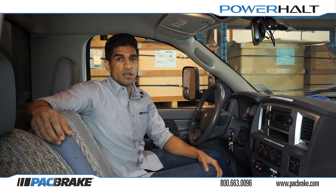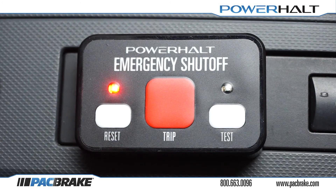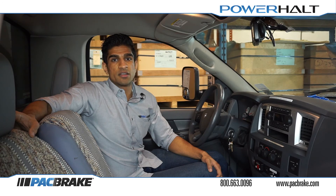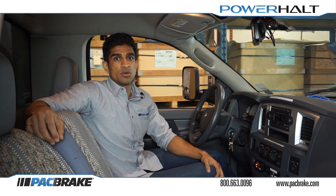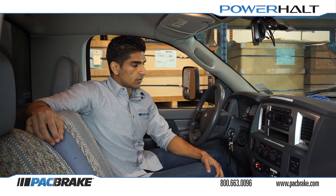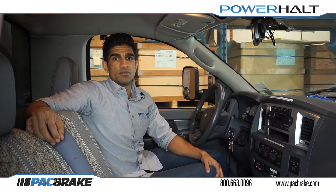We can test the setting by pressing the trip button once. The red light will become illuminated to show that the valve is closed, and once the system detects that there is no engine speed present, the red light will begin to flash rapidly to indicate that user input is needed. Otherwise it will remain closed indefinitely. Pressing the reset button will reset the valve to the open position.